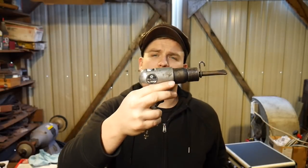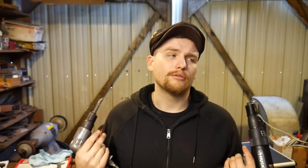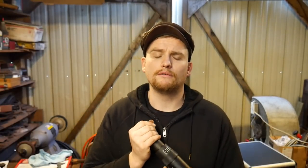This one here I got from Harbor Freight a long time ago and it's a bit underpowered for a lot of things. One question that came up was how thick a material you can forge with it — and really it depends on how hot you get it and how hot you can keep it. This design, this small short body design, fails pretty quickly on anything above really hot eighth-inch plate. You could probably get away with quarter-inch — it would be slow going but you could move it. Eighth inch is probably the sweet spot, and anything under that it'll move the material very quickly.